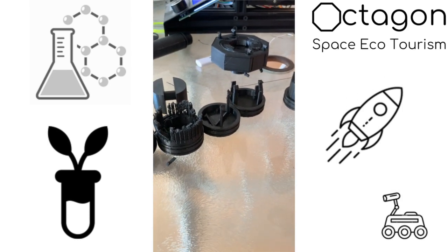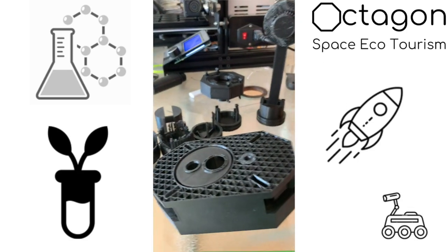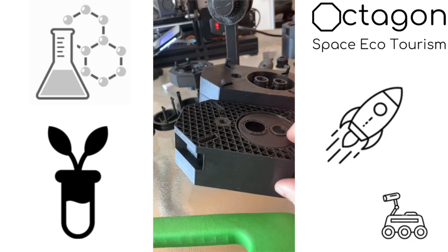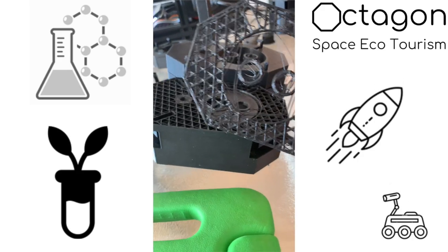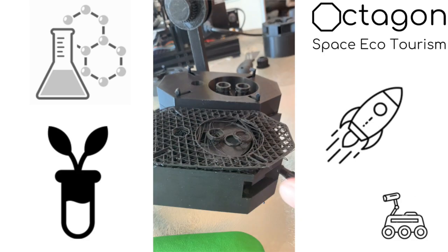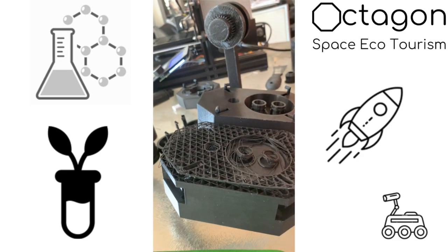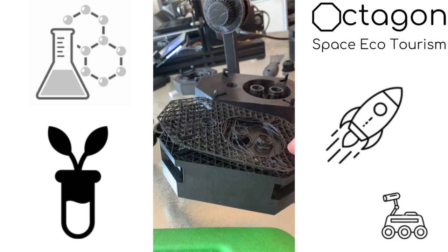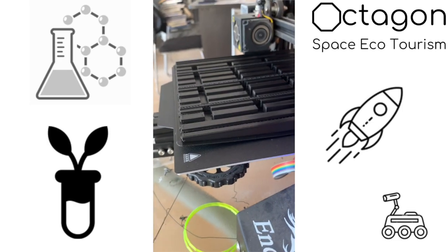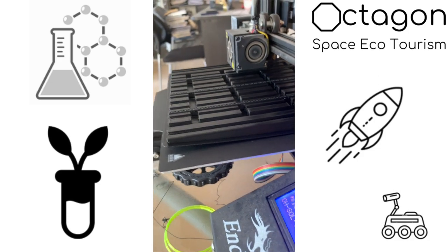The last part that I want to bring up is this one. Ran out of filament yet once again. So that's the same piece as this guy over here, and you can see the only difference is that if I put them next to each other, I ran out of filament. But the interesting part is that I kind of caught it this time, and I put in new filament. And 3D printers are pretty good at recuperating, except for this bowing process. So I thought this is kind of cool because I replaced the filament, let it go, and I just wanted to see if it would recuperate, and it didn't, because once it separates from the printing bed and it starts to wobble, you're going to have problems. Here I've got my first solar panel that I'm printing, and you can see that even with a raft, I'm still getting a lot of bowing, and that's not going to work out.